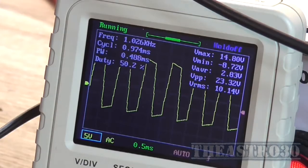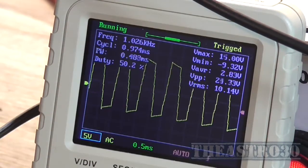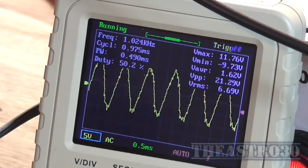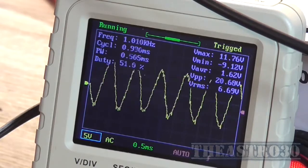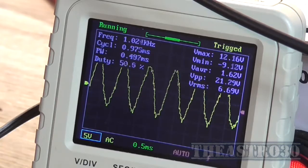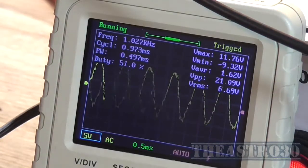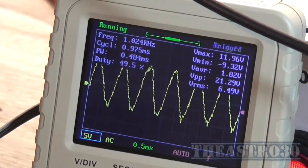Now, yeah, it still looks like absolute crap. So let's wind the amplitude down and see if it corrects out to a nice even sinusoidal waveform. We're about 300 millivolt and that looks like absolute shit. Look how noisy that is. But it is outputting. I'm surprised that there was no output before, and now all of a sudden, as soon as I took the chip out and put it back in, it's working. I don't know. Maybe there's a bad joint.